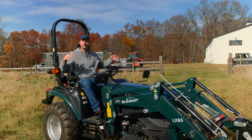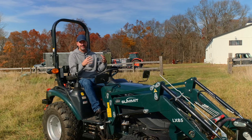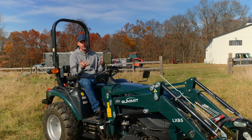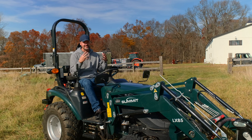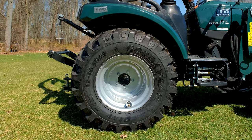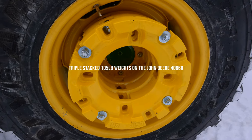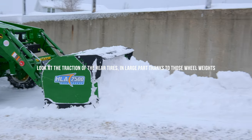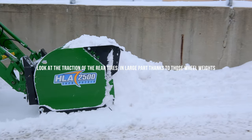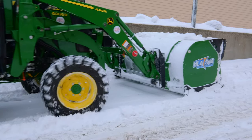Sticking with your wheels and tires, wheel weights are going to be a great option. Now, not every tractor wheel is set up to accept wheel weights. I don't think the Summit takes them — their tractor is actually heavy enough as it is — but I think there's some Kubota B series and standard L series, and other models out there, that are not going to accept wheel weights. But it's another option to get that weight off of the three-point hitch and put it there.